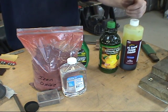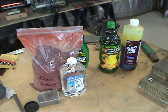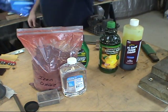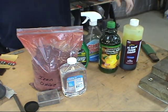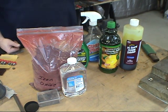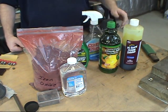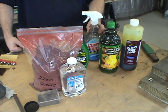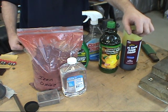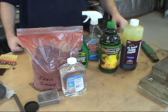I take it out and spray it off with Windex — just plain old Glass Plus is what I use. You spray that on the blade on both sides after dipping it into ferric chloride. I stand over a small bucket of water and spray the blade down with the Windex. The ammonia neutralizes the acidic nature of the ferric chloride — it's kind of like using baking soda, except I use Windex.